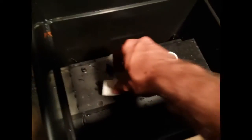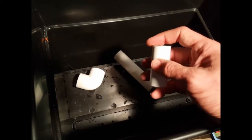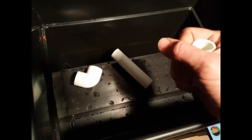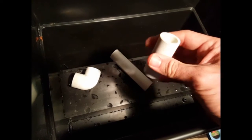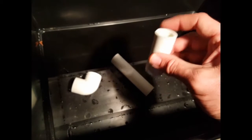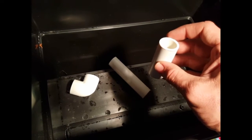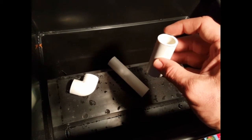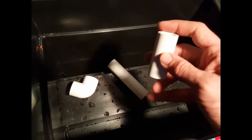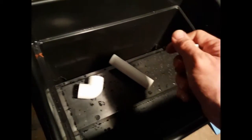As far as the height — I messed around with several options. This could be longer or shorter obviously, and as this gets longer the tube that sits over the top of it needs to be taller. Basically the water will drain into here regardless of the siphon effect, and then once the siphon effect takes place it will bring the water level down to the base of the siphon — that's also the difference in your water levels from time to time.